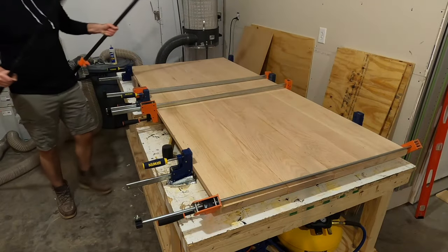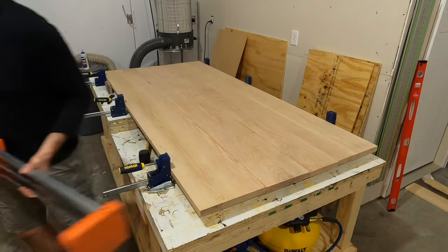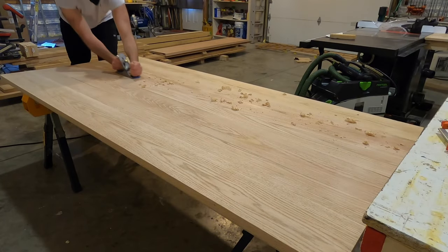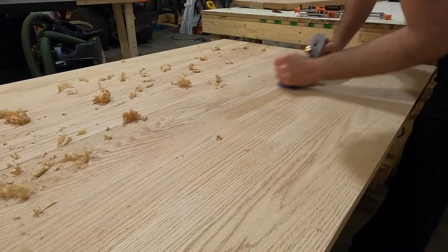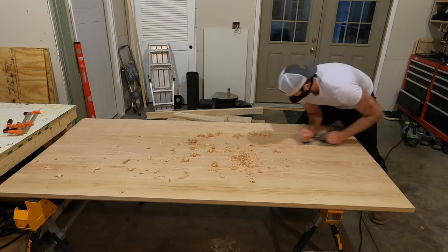I left all the clamps on overnight and then here's an up-close look at what the seams look like after they re-glued. There was pretty much no separation on here, and anything that looks like a gap is because the boards aren't perfectly aligned — that slight misalignment is what makes it look like there's a seam there, but these boards looked a thousand times better and there really was no separation. Because of the slight misalignment with the glue up I grabbed the hand plane just to smooth the top out a little bit.